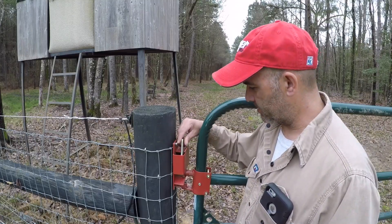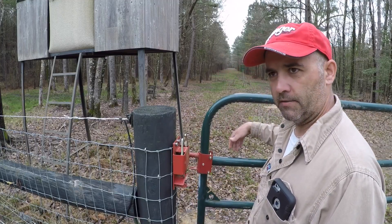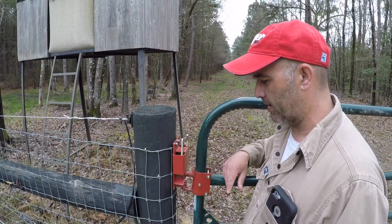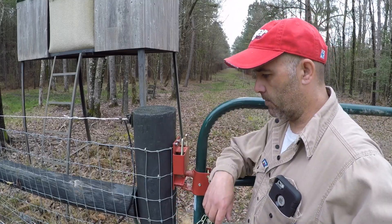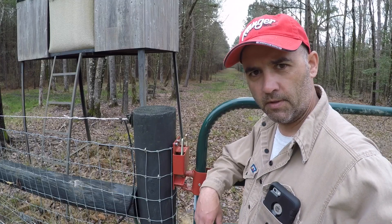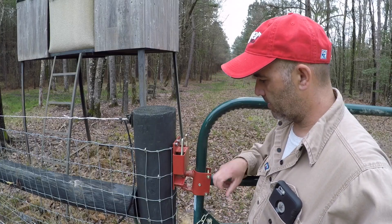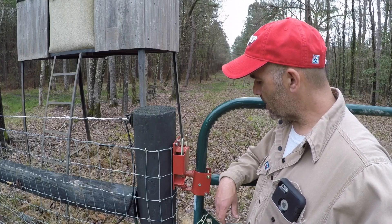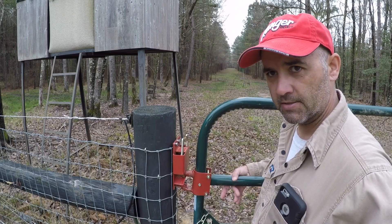Always make sure that your wire is off away from the fence and doesn't ground off. I really like these easy latch systems — you just lift the lever up to push it, then push it back and it catches in a little groove. You can go each way with this latch system, which really makes it easy when you're moving animals and equipment. You can also lock the gate so it cannot be opened. We got these online, we have four of them on each gate, and I really like them. I haven't had any issues besides having to adjust the gates over time.